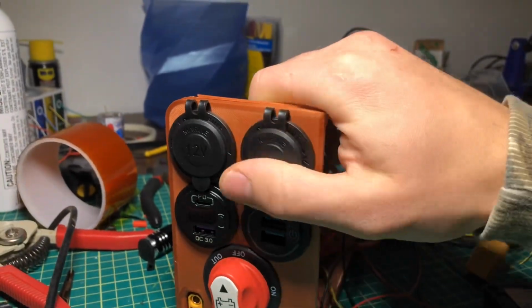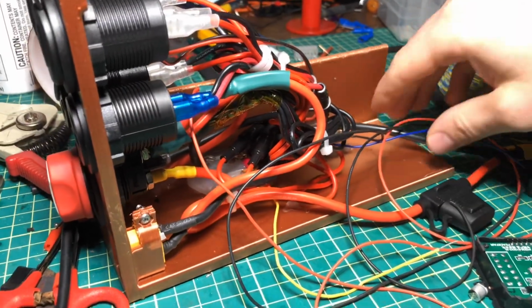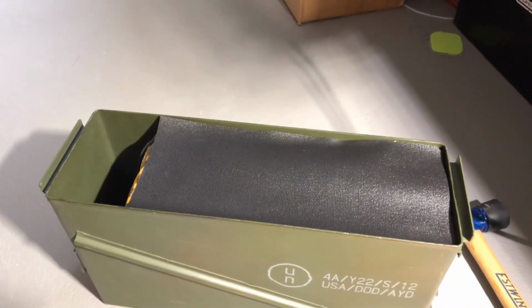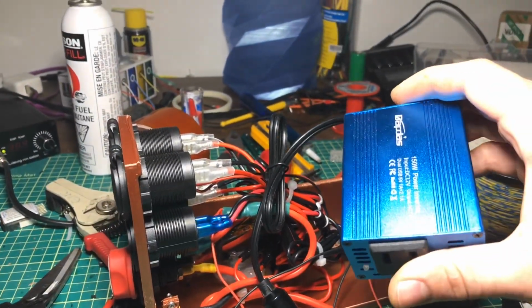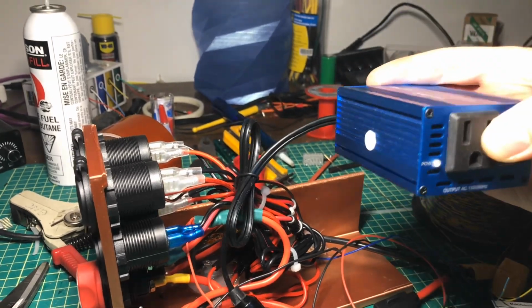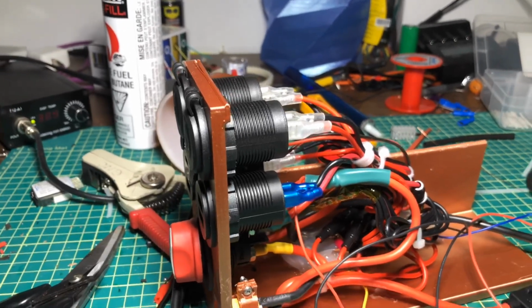which I believe I've got to get a DC buck converter to step it down to like 13 volts, because when it's fully charged the battery bank will do 16.8, and most inverters, like 12 volt ones like this, if the voltage is too high, they won't run. They'll just block the output. So I gotta fix that.